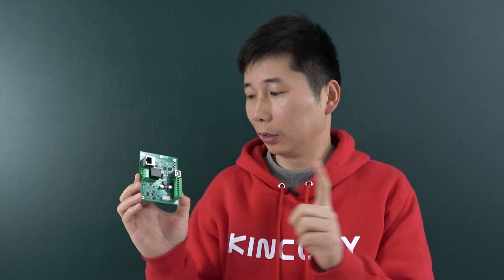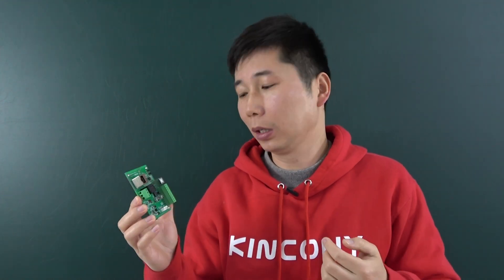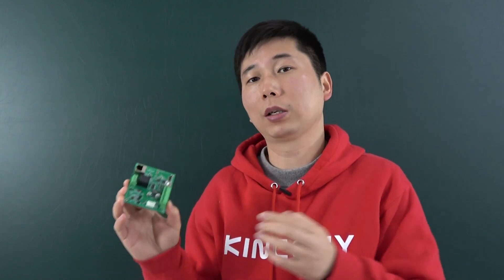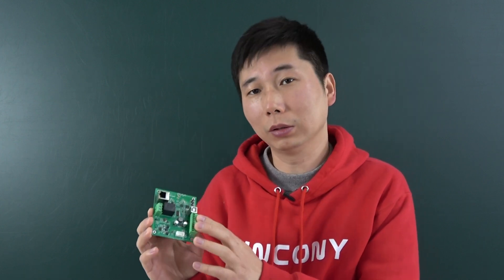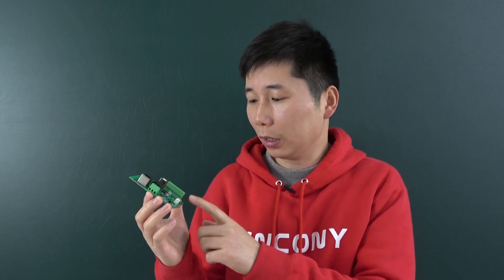You can see here only one relay, but there are many GPIOs for you to use and you can define your functions by different GPIOs. Because some GPIOs, we have already added pull-up resistors so that you can connect with your one-wire sensor such as the DS18B20 sensor, or you can connect with the DHT11, DHT22, or DHT21 sensors to this terminal. There is also an I2C extender, so you can extend the GPIO and connect sensors via this I2C port.